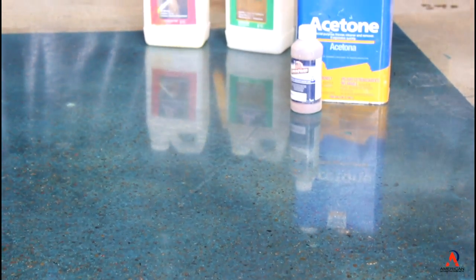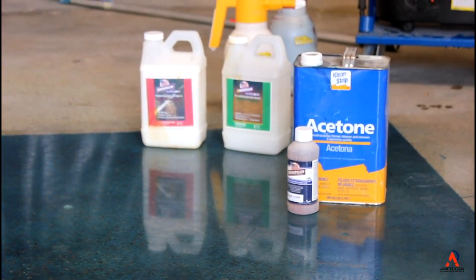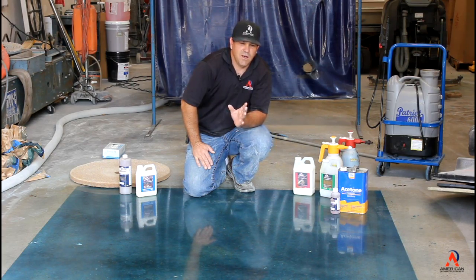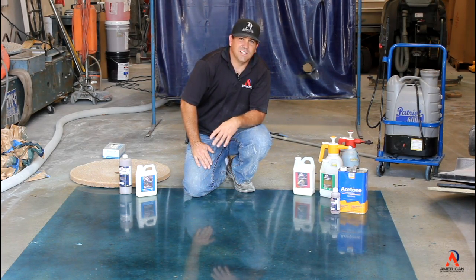Let's talk about color. When you're spraying a floor, educating your customer on color. When you're spraying your floor, you definitely want to make sure that you don't tell them that you're going to have a consistent look. Dye is translucent. If there's oil stains and there's marks underneath the floor, unless you grind those out, you're still going to see them. So make sure you educate your customer on what they're getting, and make sure they understand that those kind of things aren't going to disappear.